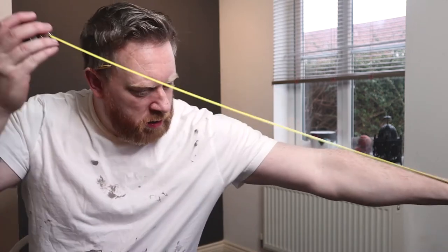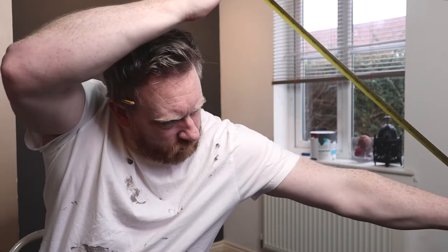The stud is 600mm from the inside of the wall. It's worth bearing in mind that there are often studs going horizontally as well, so tap around to make sure you're not going into one of those instead. I've decided to go for about 41 inches from the floor so the worktop is still usable from a standing position. It's not going to match the kitchen units around the rest of the kitchen which are currently 36 inches, but it's in the corner at a different end so it won't really make much difference.